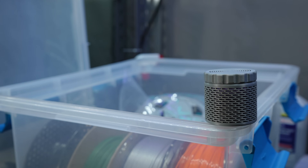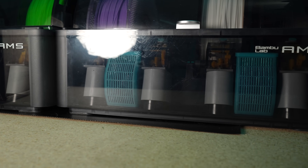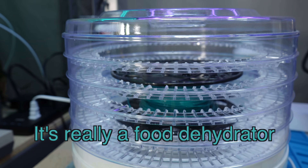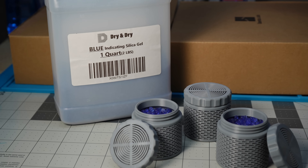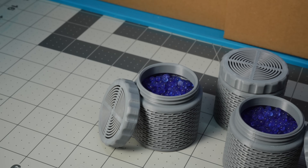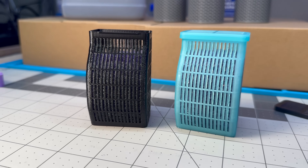I think storing your filament with desiccant, and keeping the desiccant topped up in your AMS if you're using one, is really important to keep your filament dry and stop any inconsistencies in your print due to wet filament. I have this filament dryer that I use — I bought it on Amazon, it's Rosewell branded, and I'll link it in the description. I use this to dry my filament as well as recharge my desiccant when it gets wet. I have this desiccant that starts off blue, and as it gets wet the desiccant turns purple, so you know it needs to be recharged. I use these containers that I got off Printables — I fill these with that desiccant and put them in all of my filament containers, and I use the AMS-compatible desiccant containers in the front of all my AMSs as well. I also made sure to print these out of ASA, so I can take them directly out of the filament containers, put them in my filament dryer, and dry them with the desiccant inside already — trust me, I used to take them out and had to print a little funnel and everything. Just print them out of ASA.